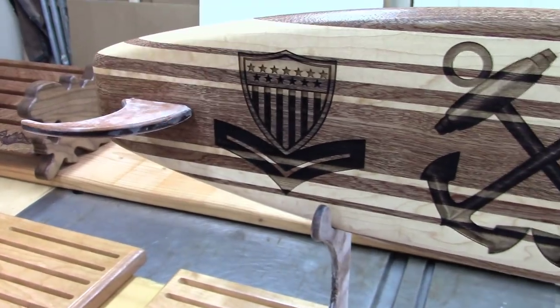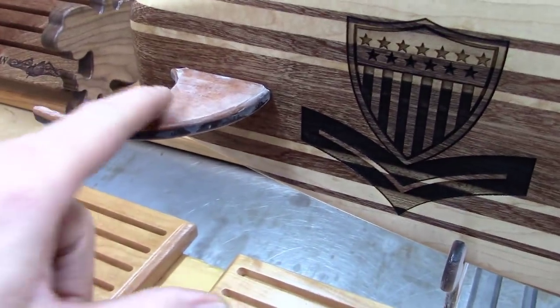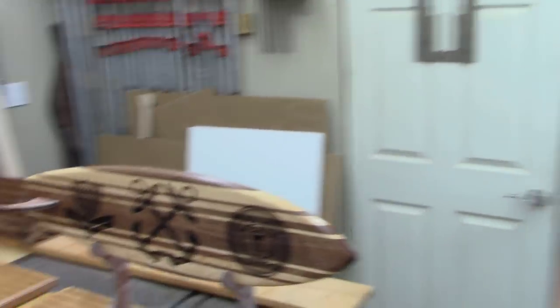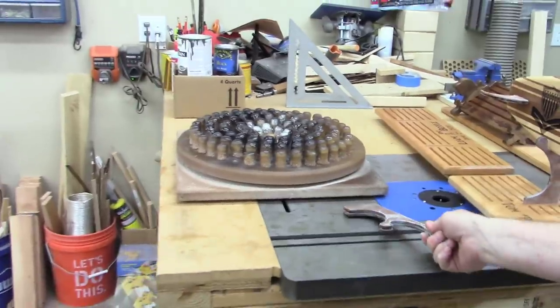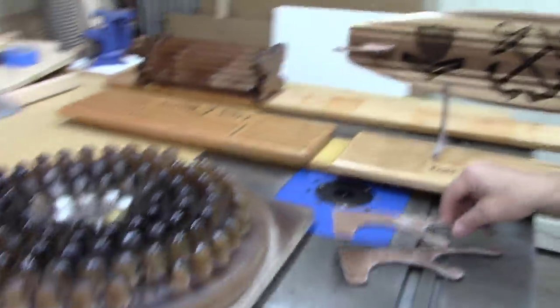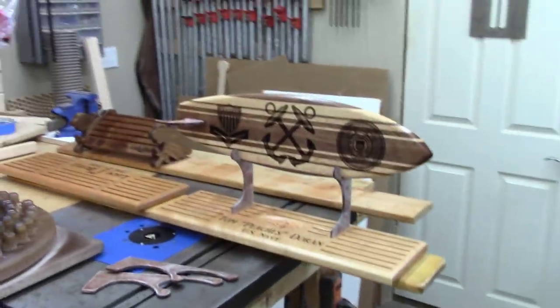So what do you do there — is it sanding? Yes, we do it with 400-grit sandpaper. It takes off the first layer of nibs and whatnot. Sometimes when you lacquer it, dust gets on there, so that first coat you put on, you want to sand it down — that evens out all the tops of the pores of the wood. You notice that sign right there says 'Men Only' — this job's all about that.